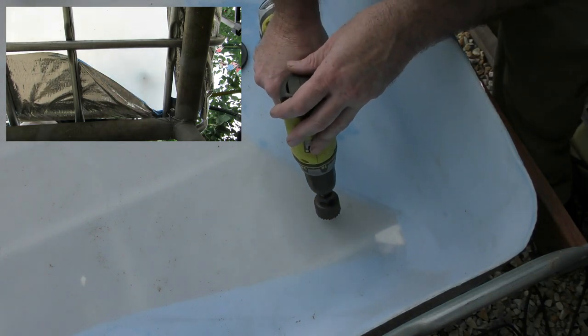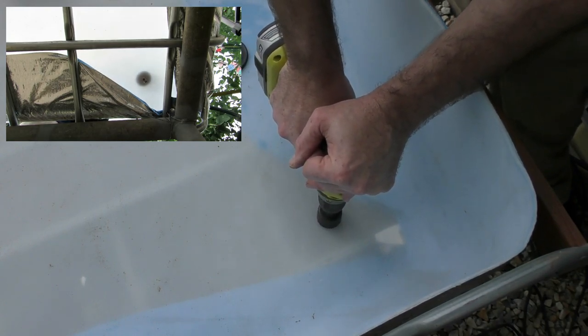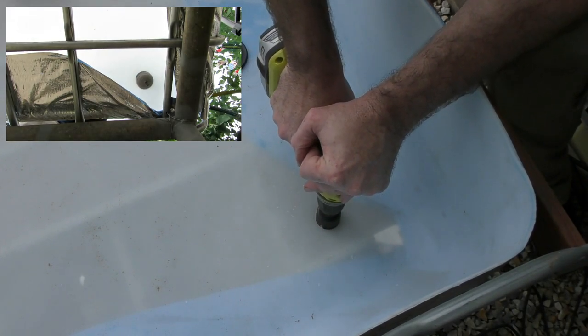It's not really a problem on a purpose-built grow bed, but with these IBCs — because they've got the metal ribbing supporting the base — you need to position it in such a way where you can actually turn the nut and lock it onto the pipework. I've pretty much positioned it, put a mark in the center there, and I can drop the hole saw right through. The trick with hole saws when working with plastic is to start the drill in forward, and then once the teeth hit the plastic, reverse the speed — you'll get a nicer, cleaner cut and won't risk the teeth ripping and distorting the hole.